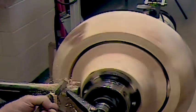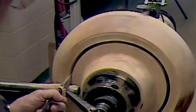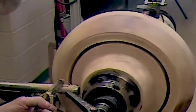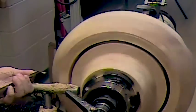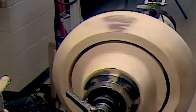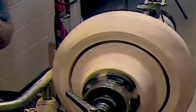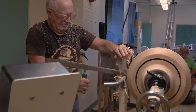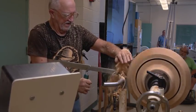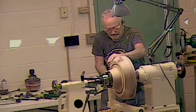So if you're looking for something to make a few cores with, just to get a little extra wood out of your effort, that's not a coring system, and I defy anybody to do this with a coring system, because it wouldn't work. This is a great tool. I've got to know how deep I am. I hold my thumb there, and I'm down to about there, and that's good enough. I can go a little below that, and go in a little bit and then angle upward to connect the cuts. Here's where catching the shavings is really good, because if I let them go right down my neck, and like I said, this hand controls everything. Once it's in there, I use the left hand a little bit to line it up, but then it's all...